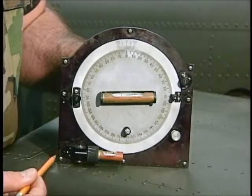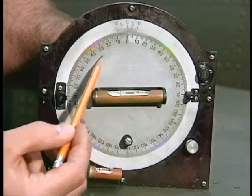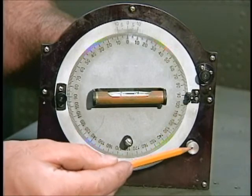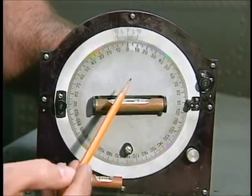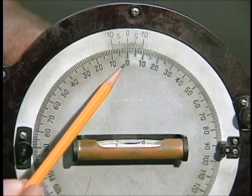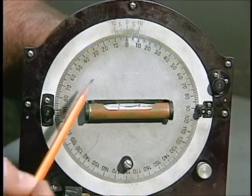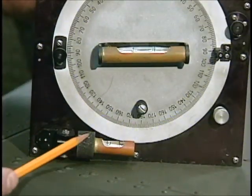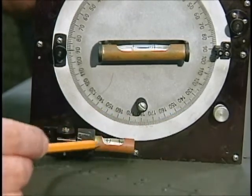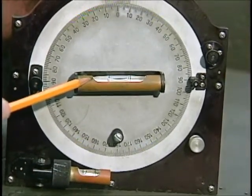This tool consists of an aluminum frame, a steel outer ring, and an inner ring. Locks are provided for locking the inner ring to the outer ring and for locking the outer ring to the frame. Scales are marked on both the inner and outer rings, and the zeros of the scales provide reference marks for reading the angle. Hand adjusting knobs allow the inner and outer rings to be rotated in relation to each other. There are two spirit levels. The primary level at the lower left corner is parallel with the indicating surface of the protractor, or the uncurved bottom edge. The secondary level at the center of the inner disc functions with the inner and vernier dials.